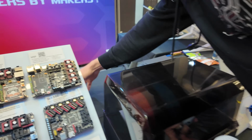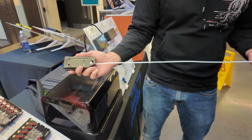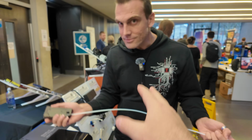It's going to come with a buffer, which is over here, and the buffer does the job of what filament switches would need to do in the tool head. If you think about it, you're feeding filament through here, and the tool head would be here. Once it hits the end, you're going to see the plunger extend. That's the signal to us that one of two things has happened: we've either hit the extruder or we've gotten stuck somewhere along the way. How do we know which? Well, you engage the extruder. Does the plunger start retracting again? If it does, we made our way to the extruder. If it doesn't, back it up and try again a few times. If it still doesn't, throw an error and pause the print. If you have a filament switch in the extruder, you get the same result, but here we can do it with logic over here, and it makes the installation so much easier. You could throw this on really any machine as long as it's running Klipper. You don't need to worry about having a limit switch in the tool head.